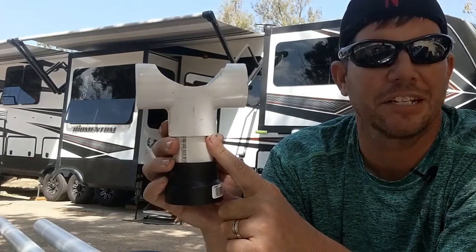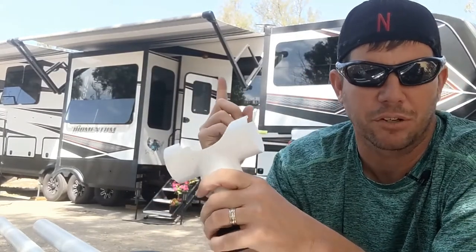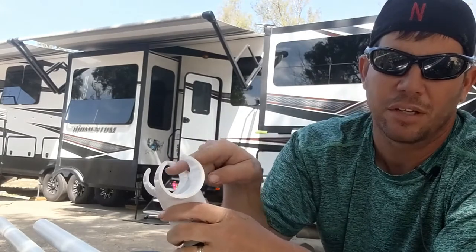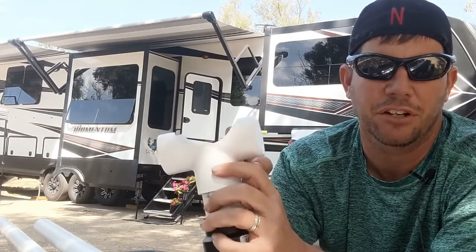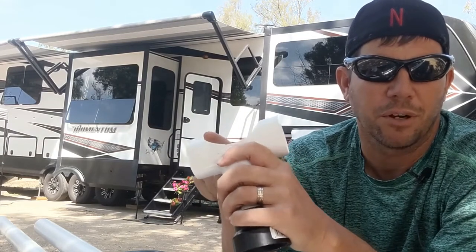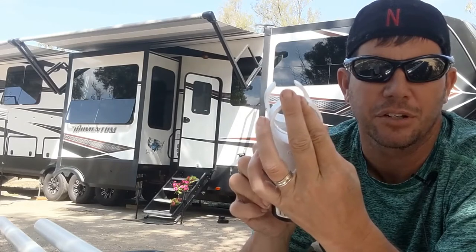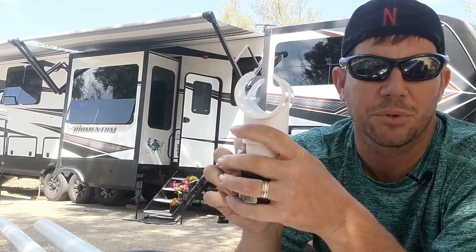A T-intersection — T-connector, I think it's called. Most awnings are going to be like three inches, four inches, something like that. I just kind of guessed on one of them, took a drill, started drilling out both sides of this, and then took a little hacksaw and kind of finished it off. Then I took a rasp or a metal file and went all the way around, made it as smooth as I could so it didn't mar up anything on the edge. Cut that piece about an inch and a quarter or so, because I use a ratchet strap and I'll show you where that connects.